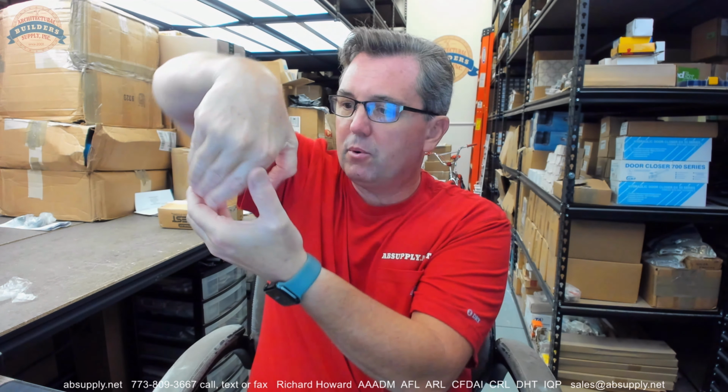I think the only thing you have to be sure of is that the lock you're dealing with has the sweet spot, as one of the gentlemen said, at the center of the lock. And I can't think of a lock where it's not, except, well, yeah, you kind of can. There are sweet spots. The center of a mortise lock to throw the throw member to draw the latch or bolt. But if you have an alarm bypass and an exit device, there is a tail piece, so to speak, that is coming off the micro switch, so that when you throw the key back and forth, you're either engaging that micro switch or you're not.